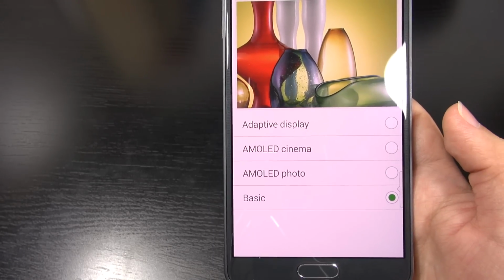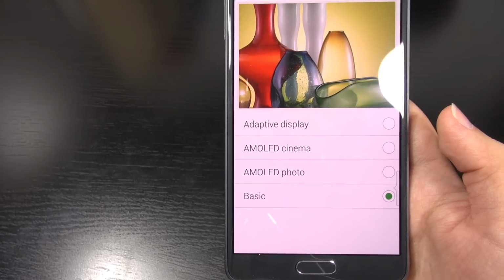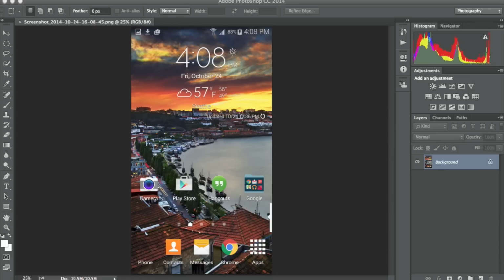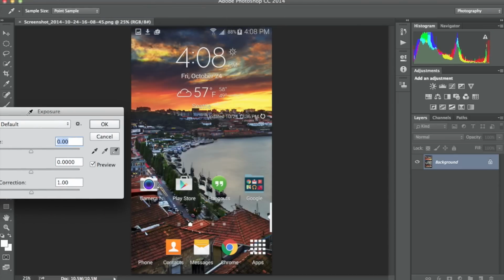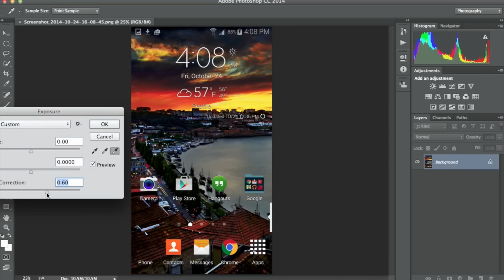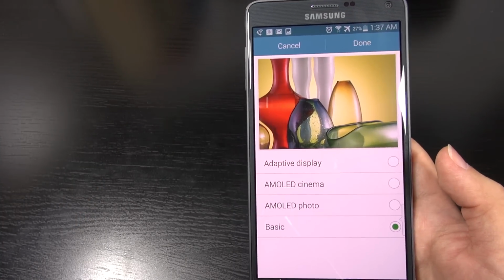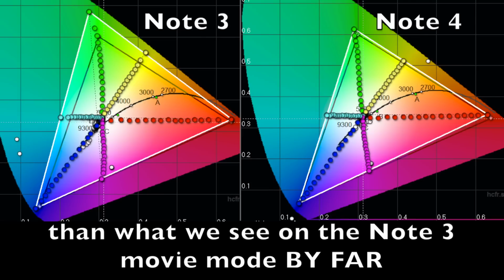And if you want to know, if you go over to DisplayMate, you look at his measurements as well, and he does say that the gamma is too high. You can have color accuracy all you want, but if the gamma is wrong, the gamma affects how those colors look. So the best way I can put it is that if you have a red and you boost the gamma, the red will get darker and more saturated. So it's not the same color as it was before you boosted that gamma. So it's not where the gamma should be. It's not sRGB standard, but it does look good for certain content. I agree. So that is really all there is to say about that.